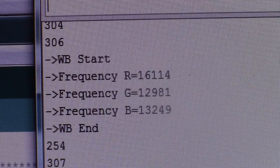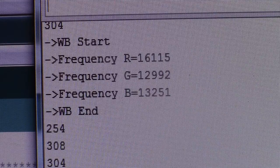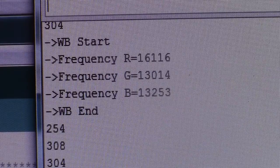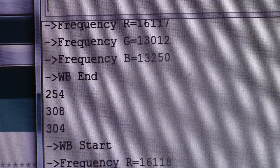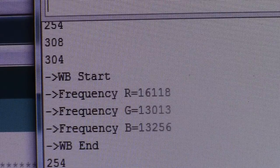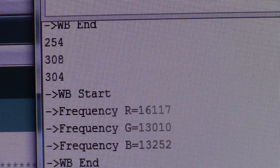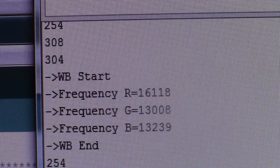It's a great little program he wrote that counts. It uses the timer1 include file, which I've used once or twice to time a frequency or to get a frequency. But he does an interrupt here, and it counts, interrupts it, and then returns the value, which is really cool. And I like the way he did that. And that's the way you learn. You get somebody who does something like that very well, and that's the way you learn.